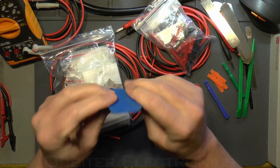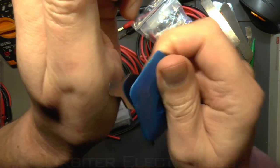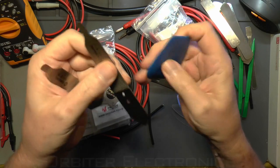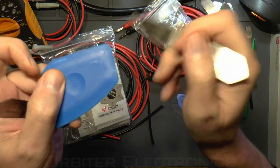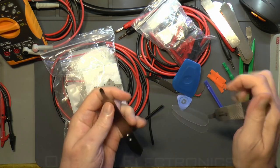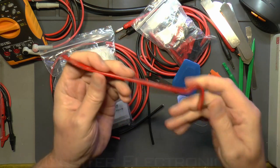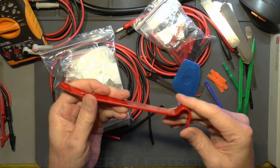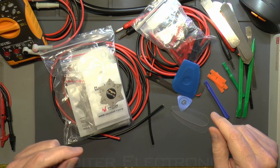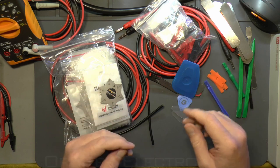I'll get behind the battery with one of these big plastic spudges, then use the edge of one of these larger tools — which are quite sharp, nearly cuttable — and I'll just lever the battery up and gently cut away at the plastic adhesive. Normally I don't have a problem doing that. If it gets really difficult, I'll use the mini pry bars, but that's more for car battery stuff. Those mini pry bars do come in handy for levering heavier duty items where things have become really stuck and general purpose spudges just won't move it.